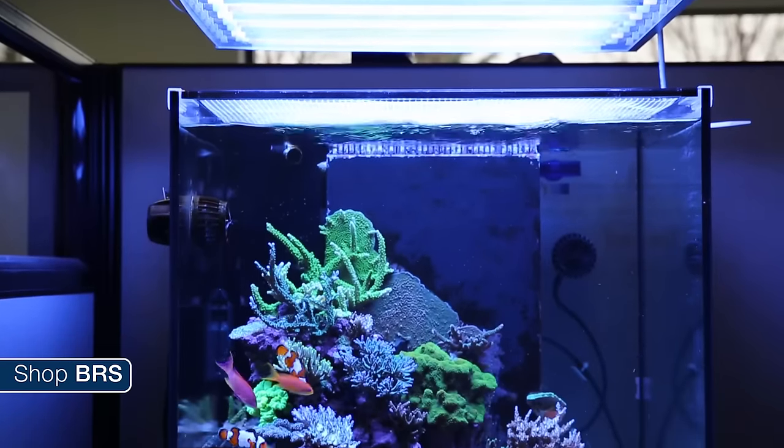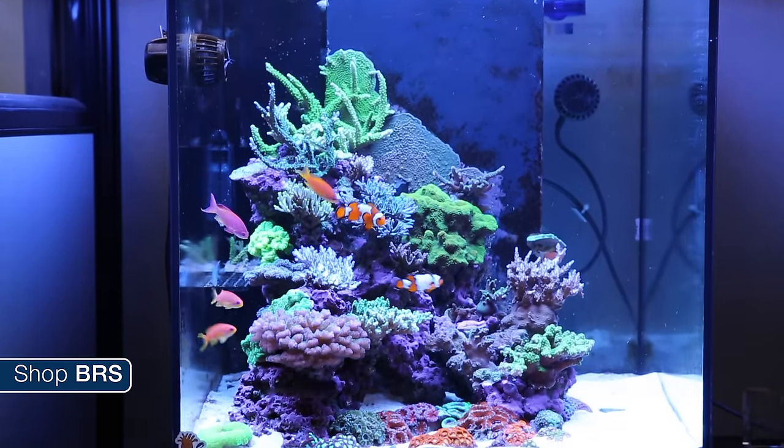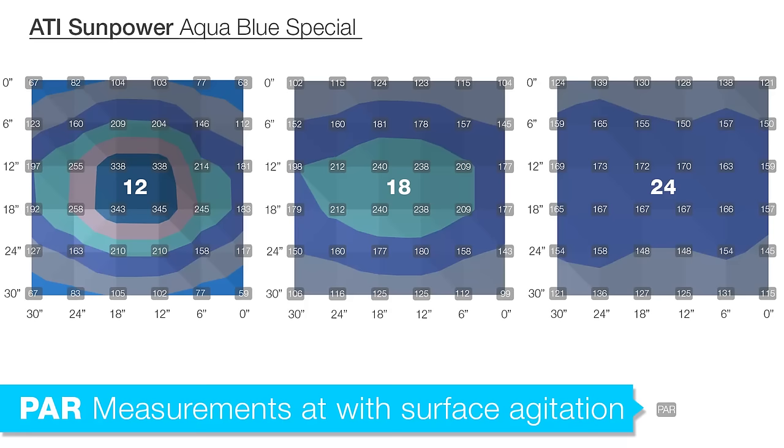At 24 inches from the light, the average 36-point measurement is actually 27 percent higher underwater than in air. There is only a 1 PAR difference in the center 6-inch average; the mid-range 18-inch ring is 14 percent higher underwater; and the outside 30-inch ring is an amazing 50 percent higher underwater — all because at this depth the glass is reflecting and redirecting light all over the tank. This redistribution of light is producing what many might have thought was impossible: just a 10 PAR difference from left to right over an entire 30-inch grid using just a 24-inch wide light. We also repeated the test with the MP10s to simulate surface agitation and there was even less impact in this case.